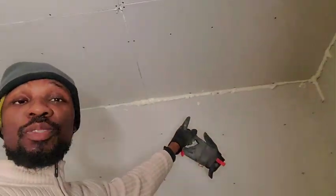Finally it's all cleaned up in here, everything's pushed back in the closet. If you look in my corners, there's foam everywhere. That's a quick little carpenter's trick - you put foam in all your areas that just didn't line up. It happens. I'm going to take this foam and shave it all out so there's less caulking to do. Right now the whole room looks like Frankenstein between the foam, lines, and nails. Now it's time to start mudding - mud up all these walls and all these gaps.